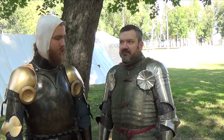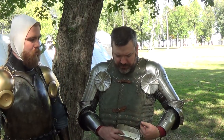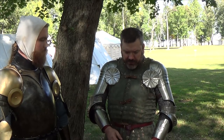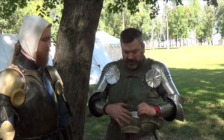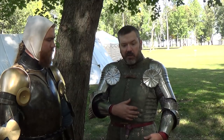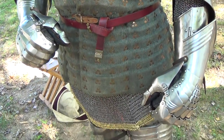It's custom mail. So Tom, tell us about your kit a little bit. I've got a brigandine, which is a series of plates attached to a fabric shell. The plates overlap, they're riveted to the fabric, and allow some flexibility and movement. These particular plates are heat treated steel that have been coated in tin — dipped in molten tin to rust-proof them. This particular pattern of the plates and rivets is based on about a 1475 brigandine.